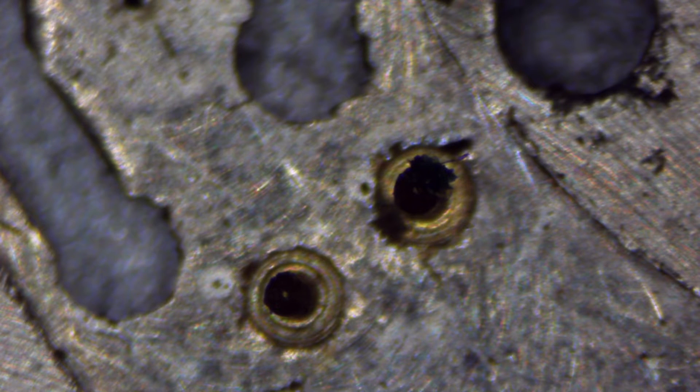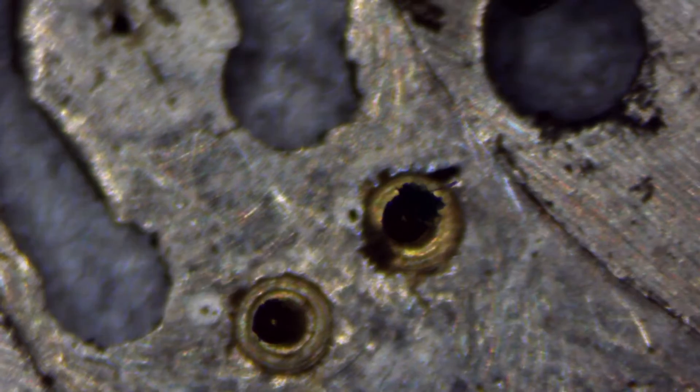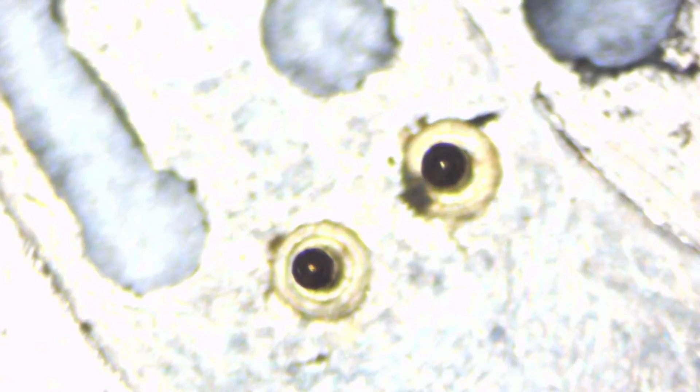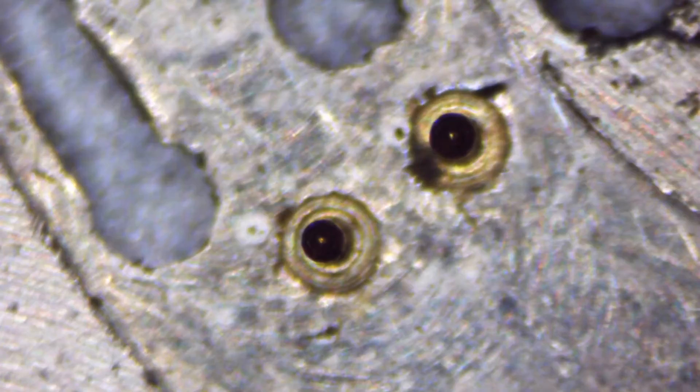Hey, I'm JD, welcome to my channel. I figured before I started work today I'd give you a few more close-ups. Here I've got a very small Russian watch movement, and this is the lower plate from that Russian watch movement. I've got a piece of Rodico in my hand here, so I'm going to just dab these jewels to see if I can clean them up a bit. Look at that — I removed whatever that was.